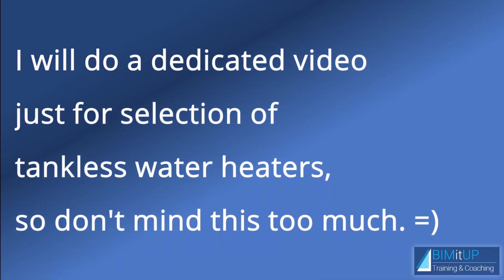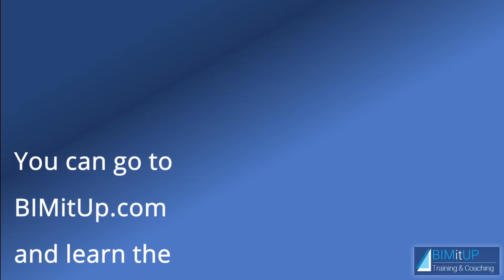And in addition to that, I'll have the digital display, and I'll have this knob that will let me adjust the temperature to the exact degree of the outlet water that I want. And in this case, we're not going to perform calculations for the water heater because it's going to be a 1-to-1 replacement, and we have a fixed 60 amp double pole breaker available. So that's what we have, and we have to live with it. But if you want to dive into how to properly select electric tankless water heaters or any other water heater, you definitely can go to bimitup.com and get some training there.